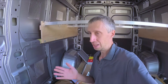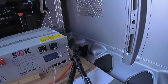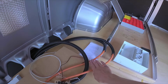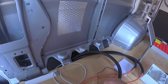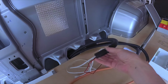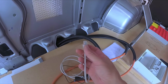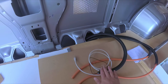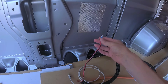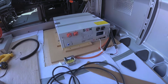I've already powered up the Victron inverter inside — it took me three or four hours to actually get connected to it properly, which was not so great. I've run all the big power cables. The two chunky battery cables are running through the section of the van to where the inverter is going to be, and I've got an extra cable run for any accessories which need to go between here and the battery. Running through this third duct here I have a custom made cable which is the CAN bus BMS communication between the Victron and the battery. I've also run the thermistor through as well — that plugs onto here. You might as well have the temperature sensor on the battery; can't do any harm, even though theoretically it'll protect itself.